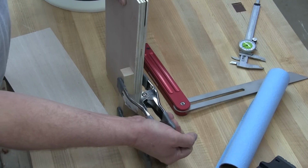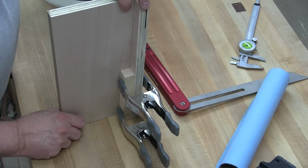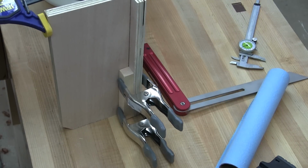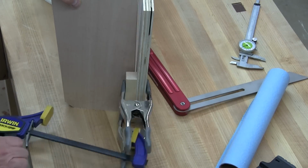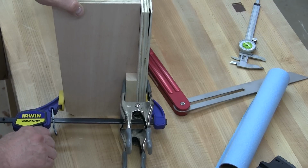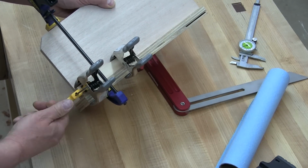We're going to take the pieces we've got all with the bevels and everything cut. They're ready, so we're going to take our setup block again, and we're going to use our setup block to put these boards together. Bunch of clamps. And we use a nail gun actually to put these together. It just seems like the easiest thing to do. There's no stress on these joints or anything. It just needs to stay in place. So I'm getting them all lined up here and tested out, and then clamping that little block on the bottom.